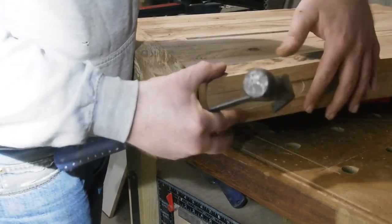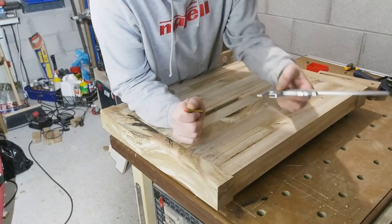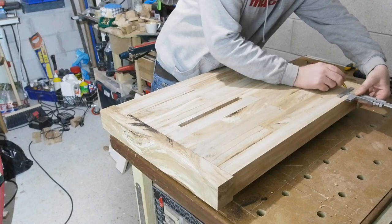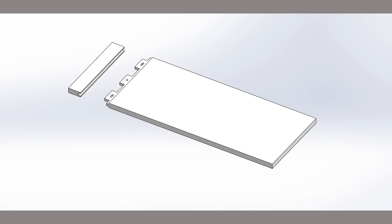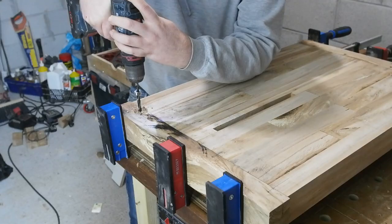Before I get to drilling, a quick word on breadboard ends. They're not needed for your tables or work benches — they're basically a design choice, think farmhouse style. I'm using them purely as I have a working width in mind but also want a big blobby round over; the breadboard ends give me the extra length to accommodate that. There's a traditional way for doing deep breadboard ends — a full-width tongue, also often seen with a series of tenons. It's time-honored and will serve you well. But if you want the most efficient way, it's probably large dominoes doweled at the breadboard end.